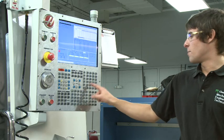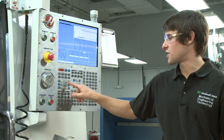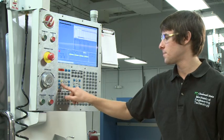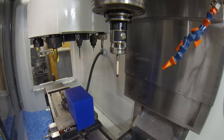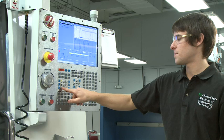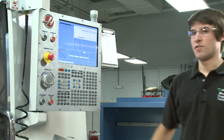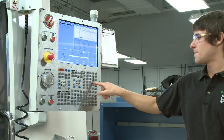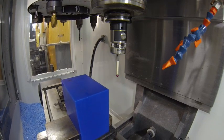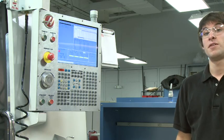I'm going to go into hand jog mode. Remember, these keys select your jog rate — I'm going to go to the quickest here — and select the axis you would like to jog over here. I'm going to do Y. You can jog it using the jog handle, or you can jog by holding down the axis you would like to jog. Whenever you're jogging your Z, I recommend you use a slower jog rate, maybe 10 thousandths per click. That gives you a lot of control. Make sure you understand the jogging before you actually go to probe something, because you will need to position the probe to where it needs to be.